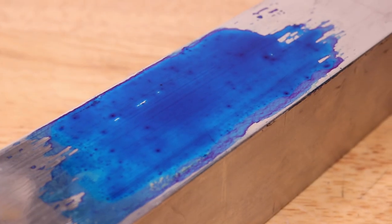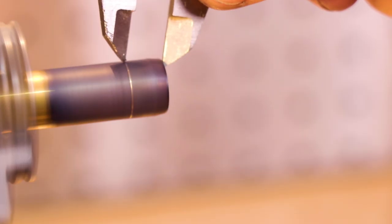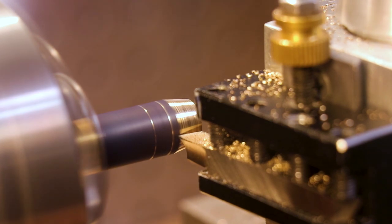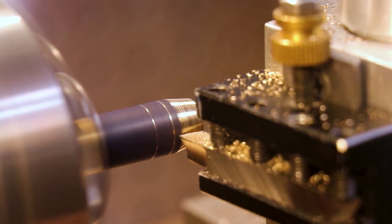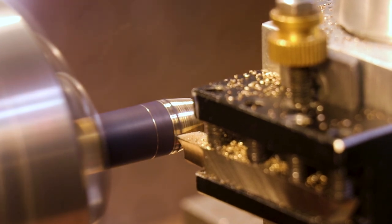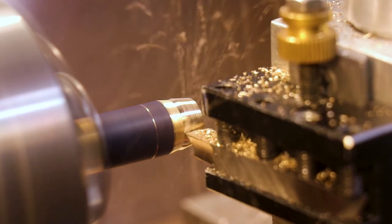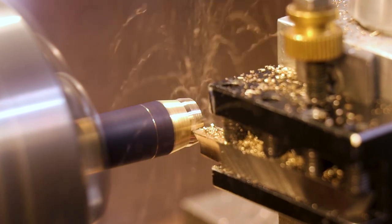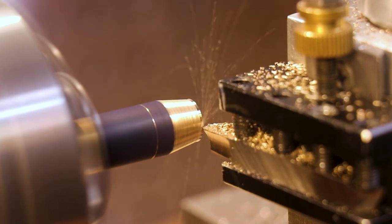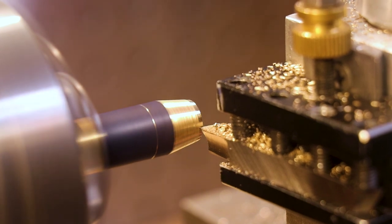To sum it up, if you live in an area where conventional layout fluid is not practical to get or affordable, this cheap shellac substitute is a great alternative. Even though I showed that most off-the-shelf dyes should work, I do recommend that you use gentian violet or Prussian blue due to the deep saturation they can achieve. Finally, in my opinion this method is only necessary when you need good staying power from your layout fluid — when lines need to be quickly added and removed, a permanent marker should suffice because it dries so much quicker. Thank you very much for watching.